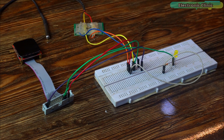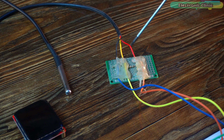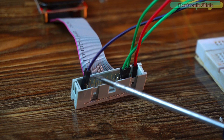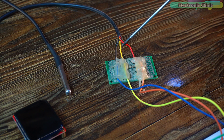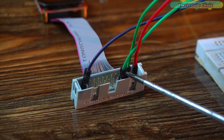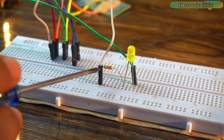Before you start the interfacing, make sure to download the pinout diagram — it will save you a lot of time and confusion later. Connect the voltage and ground wires of the DS18B20 to the V-Bus and ground pins on the GPIO connector ribbon cable. Connect the data wire, which is usually the yellow wire, to GPIO16. Connect the cathode leg of the 3.3V LED to GPIO21, and connect the anode leg to the V-Bus pin through a 330-ohm resistor.